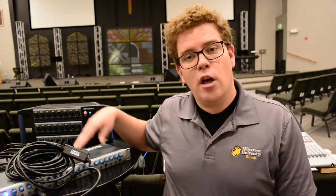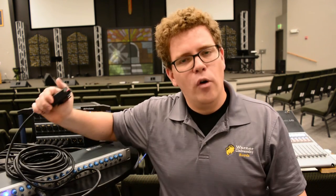This works best if you have either a monitor engineer, or if you use an app connected to your front-of-house console allowing individuals to mix their own ear mixes. In our case we use the latter method. This console right behind me can be connected to with an app called QMix-UC. Each of these headphone amplifier channels receives its own individual mix. We're using mono so we're only using six mixes, but we could use them in stereo which would occupy 12 mixes on the console. Then each musician — both instrumentalists and vocalists — can decide to hear more of this or less of that, and mix their own ears that only they hear.